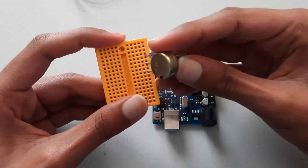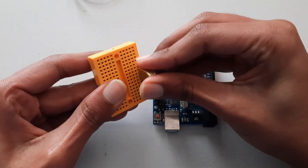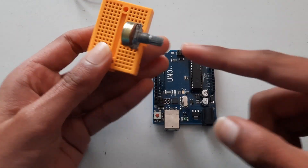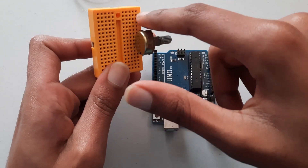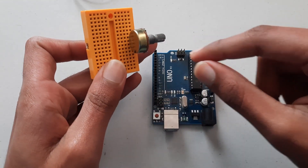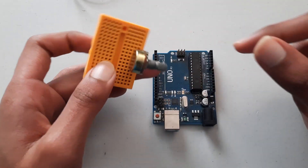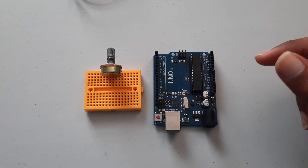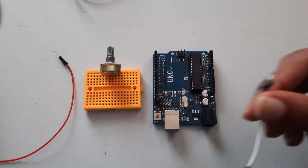The first thing you need to do is put the potentiometer on your breadboard — plug it in like that. Make sure it is on the longer edge, since all these rows are connected. There is a metal wire going down each of them, and if you plug the potentiometer into one row it would short it out.